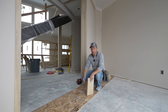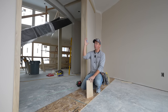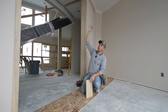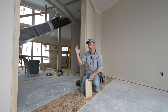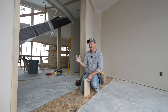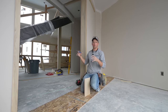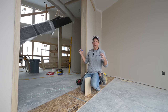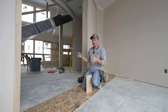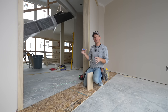Making a form with a radius this way was definitely quick, but there are some downfalls. One being that my wall might not be plumb, so I might be scribing something down on the floor that isn't exactly the same up where I'm going to put my header. Also issues with framing — the radius isn't quite perfect and you can even see it's got some odd little bumps. I had to decide either do it this way, or pull measurements off the blueprint and get more precise with making the radius in the shop.